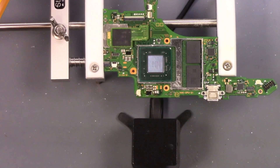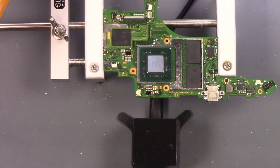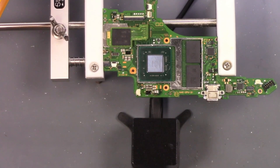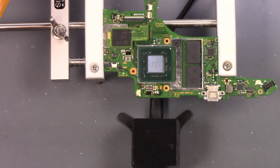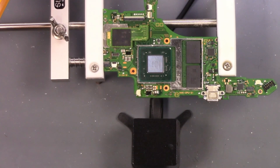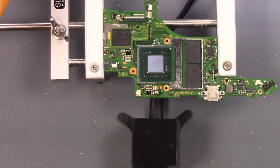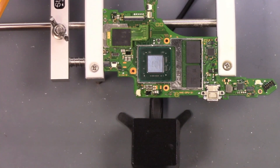So that should have gone down. I still had to use a little bit of hot air, but the hot plate concept works. So that's going to do it for hot plate concepts — you can float them down, but you need a touch of hot air. If I had put leaded solder on it, it might have gone down with just the hot plate, but with unleaded, I had to run the hot air.